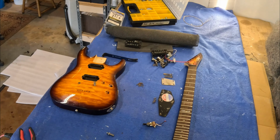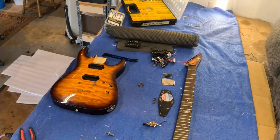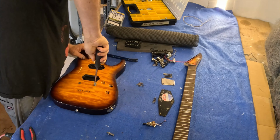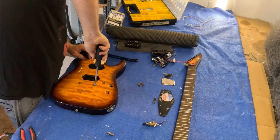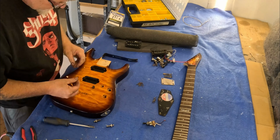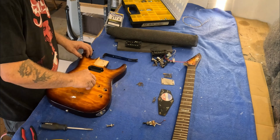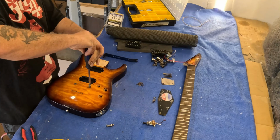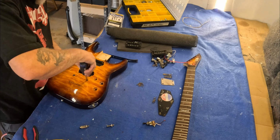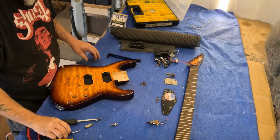Looking through all my little collections of nuts and bolts and all that stuff, I had nothing with the right thread size at all. So I had to think on the fly about how I was going to get that out. What I did was look for any small little screw that I could slip in there that will fall all the way through, but not be wedged on the inner threads of the sleeve, and kind of used it as a spacer.